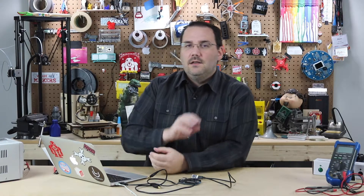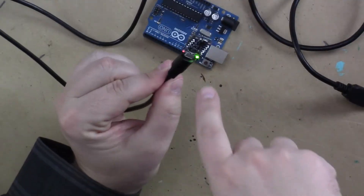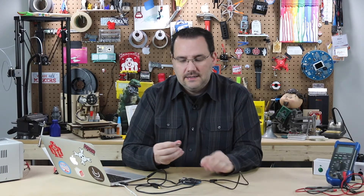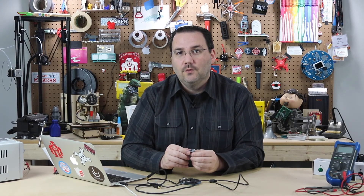Once that's all done, take a look at the documentation — remember, we're not going to blink pin 13 on here. If we want to blink the built-in LED, we're going to blink pin zero. That's all clearly documented on their website. The Trinket is a really great dev board for the ATtiny platform and I highly recommend you pick these up for your Arduino prototyping toolbox.